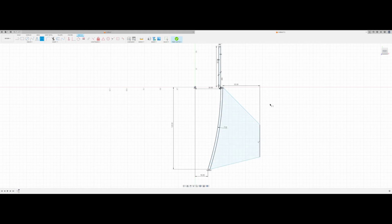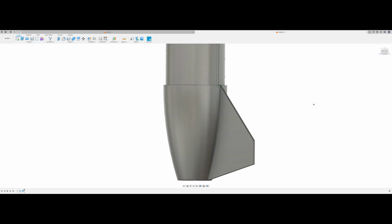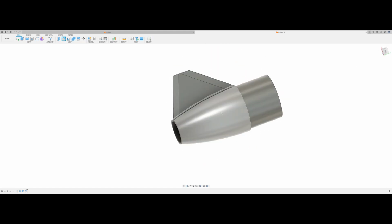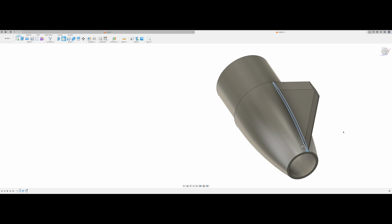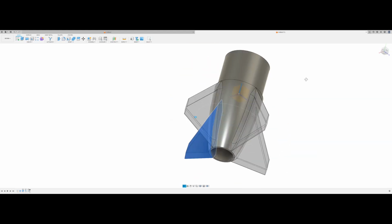Because we're going to be 3D printing this mold, there's no reason not to include features like a boat tail, beveled fins, and large integrated fillets. In fact, as we'll see when we go to slice these parts later, compound curves like this can actually give slightly better surface finishes, since the layer lines won't be as consistent and stair-steppy.